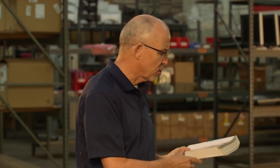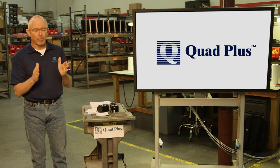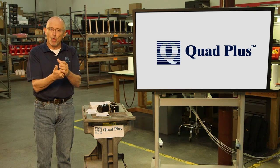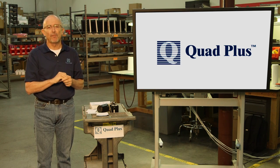To understand what's going on, let's look at some capacitor basics. To create a capacitor, it's quite simple: you get two plates, put a charge across them, and bring them close together with an insulator between them — it could be a piece of paper. In the case of modern capacitors, they use two pieces of foil with an insulating paper. The amount of capacitance is directly proportional to the area — so if you have a very large sheet of foil — and inversely proportional to the distance between the foils. So you want a very large area with the two pieces of foil very close together. Manufacturers get the foils together and then roll them up, which is where you get the traditional round shape of the capacitor.